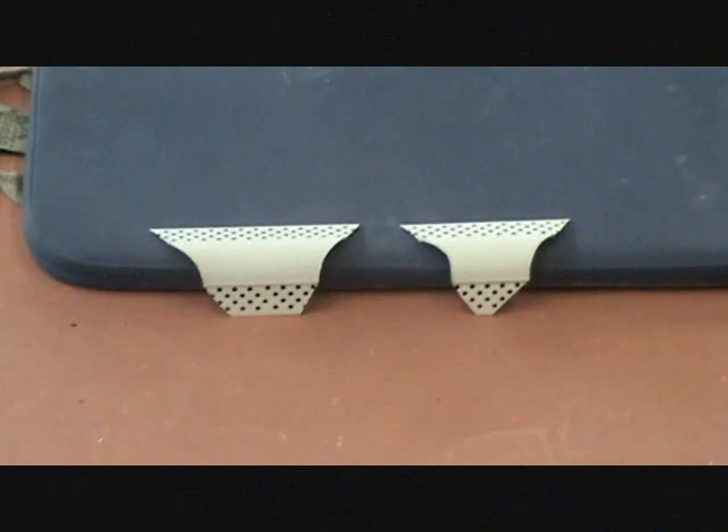I cut these two little pieces out — I'm making these as templates for my outside corners. With the bull-nose, you can't just cut at a 45-degree angle because it's rounded, so it's a little bit of trial and error. I use a little square and cut a couple little pieces first, because they're not exactly a 45-degree angle. And you see there's some little cutouts, some whoop-de-doos in there.